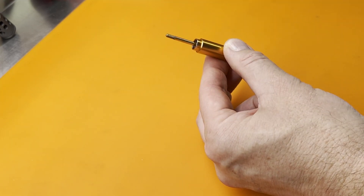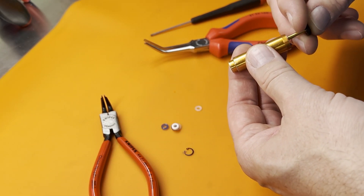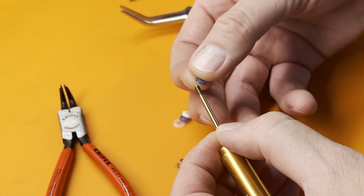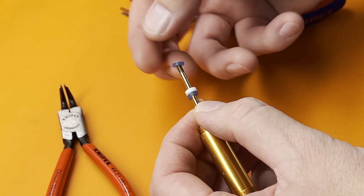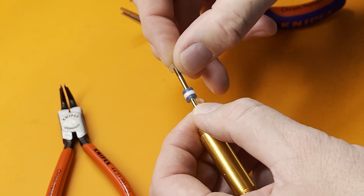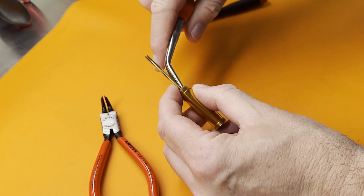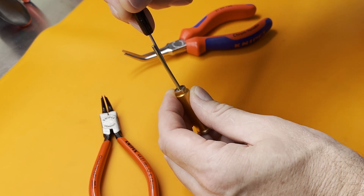Try it this way instead. Here is the smartest way, in my opinion, to build most RC car shocks. Start by putting your piston through the body first, not last. Then we're going to build up the seal stack — you'll see how easily these go on. You're not damaging the O-ring or the quad ring as it goes over the threads. Then, once you have it together, push it all into place. You can push it in with some pliers or with a flat-nose wrench, something like that.